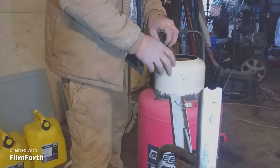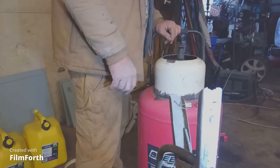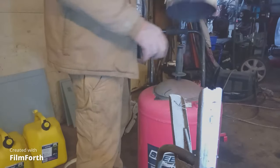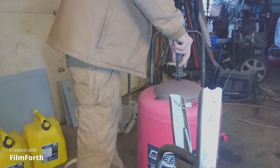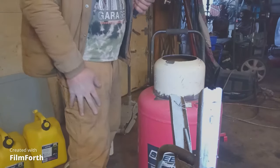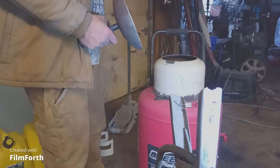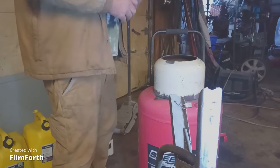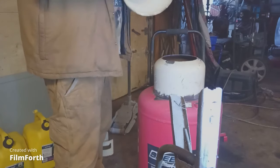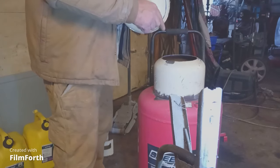I was thinking if I took it sideways, would it open up the bottom hole - but not really. Maybe I need to cut this plug smaller so the sand can flow past it once the sand's dumped in. So I need to cut this smaller, and to make the integrity on the top better I'll have to weld something on there so it doesn't splay open and tear - we don't want that to happen. I think the sand should go past that.